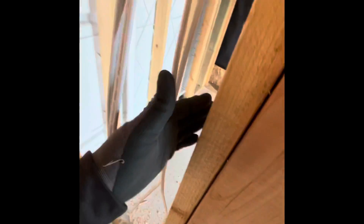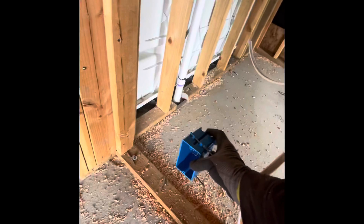They haven't put up the two-by-four yet, so we can't put the box here. The box isn't going to go right here — it'll most likely go somewhere over there. Can't put the box up because there's no two-by-four. This is gonna go right here because you have to have a plug every six feet before the door.